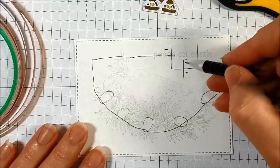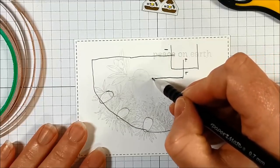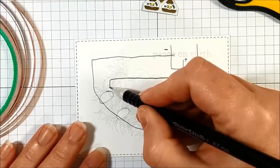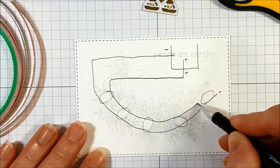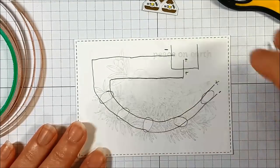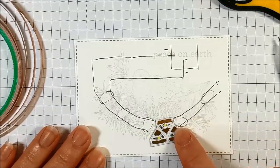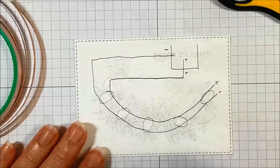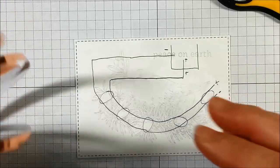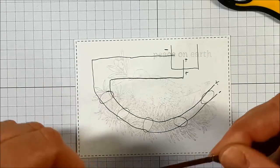We're going to create our positive trail and take it out from the battery pack, over and across, touching all of those lights with our positive trail. These two lines have to be touching our triangle of lights. You always have to plan this out first. You can slightly adjust the sticky copper tape, but you need to at least plan where you're going because once you take the backer off, you've got to pretty much put it down.